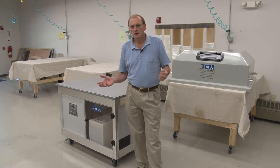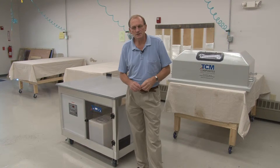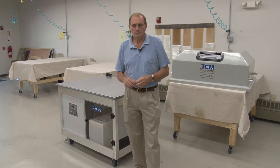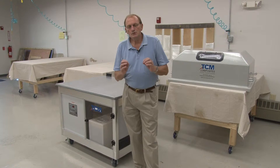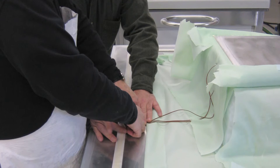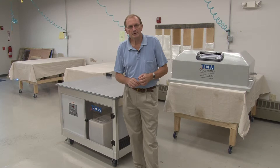This is an absolutely perfect system because you have a lot less setup time, a lot less prepped material, and batches of material sitting around. In enclosed molding it's one of the cleanest processes you can ever see. If you go into a production process with metered mixing, you have a completely automated process. The cure on demand is really the big difference — it changes so many parameters in what's happening in the shop, because you don't have to do all that prep work and you don't have to rush into getting a part completed. You have all the time in the world.